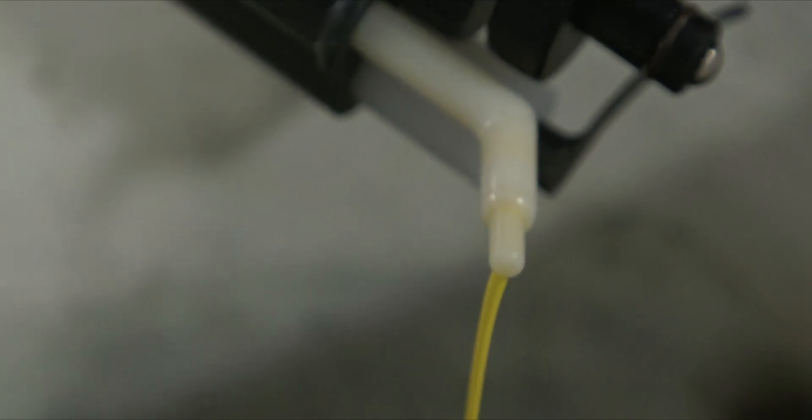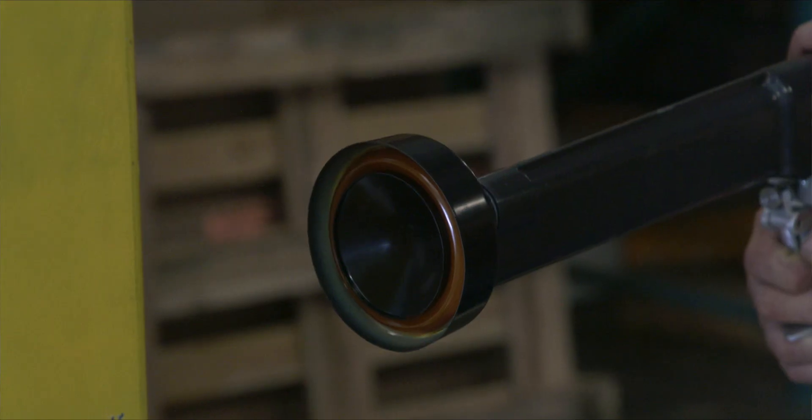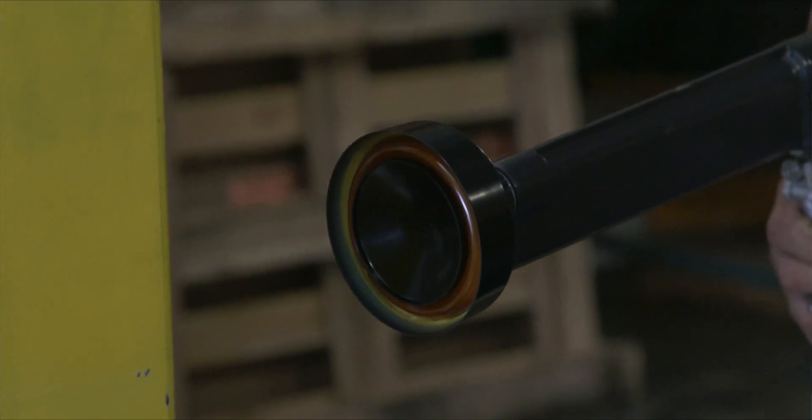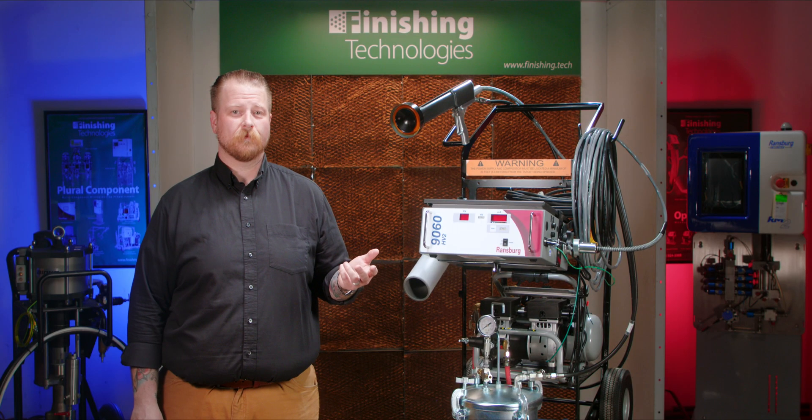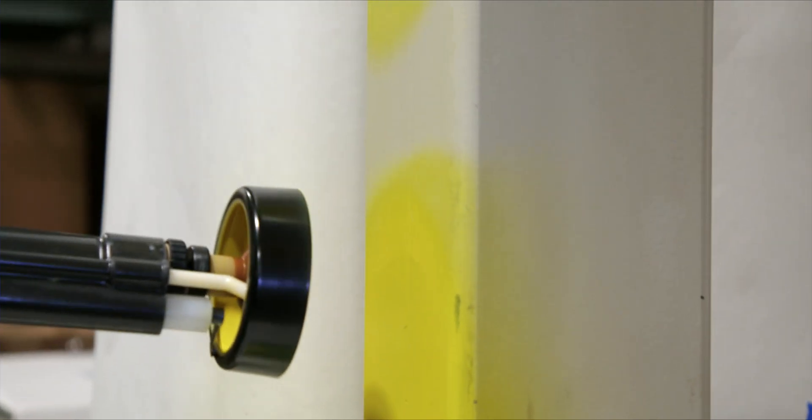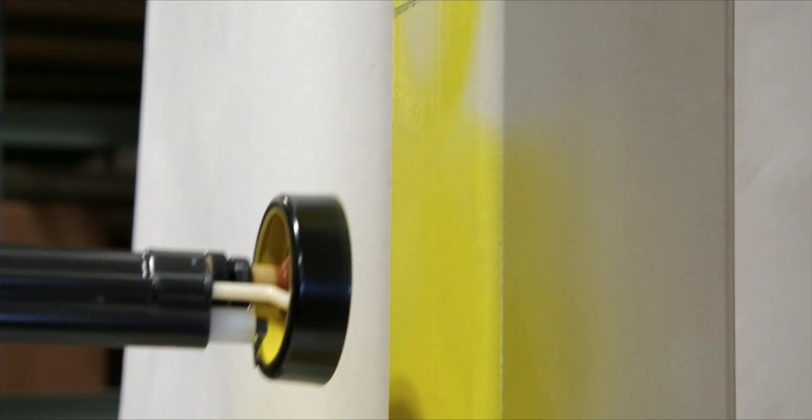The tank is pressurized by air from the included compressor, which causes the paint to move through the hose to the gun. The fluid emerges from the special dispenser that streams it onto the surface of the spinning bell at the end of the gun. Once the fluid contacts the bell, which again has that special electrically charged coating, the paint is dispersed onto the inside surface and then it is negatively charged at the edge of the bell cup. Now charged, the paint is attracted to any grounded object — your intended substrate. The painter then just keeps moving and a new color appears on the substrate as the gun is moved across the area being coated.